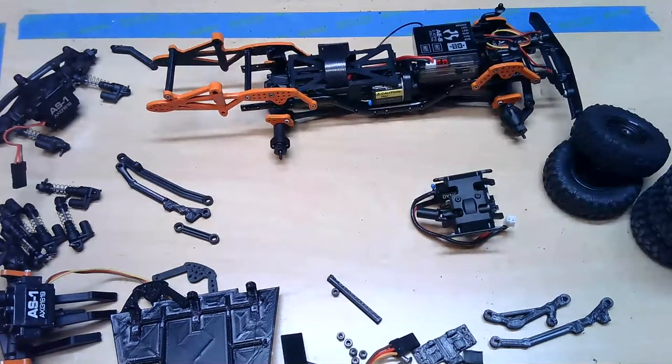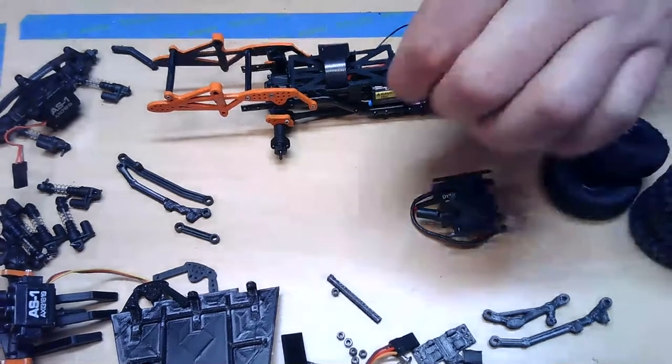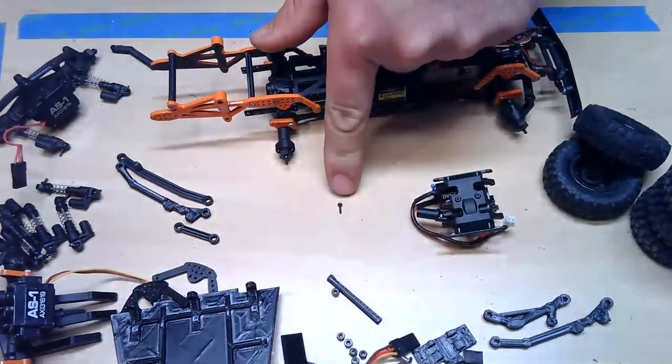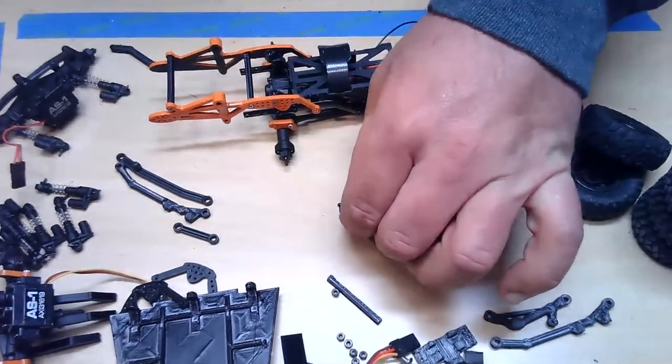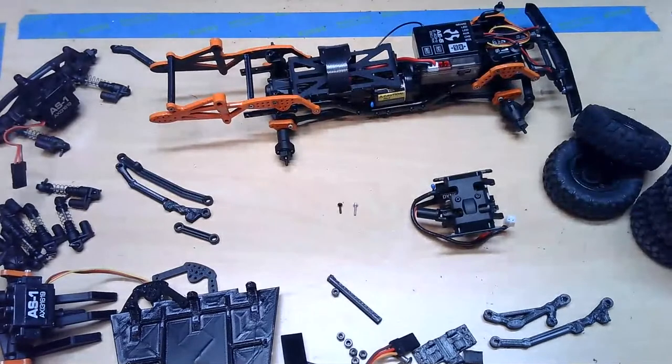It's really hard to find these stinking screws. The screws themselves are 1.4 millimeter diameter, or M1.4, and of the main lengths that I get, I don't even worry about the 5 millimeter ones. The stock ones that come in here, in almost every screw in here, is that little bitty guy, which is a 5 millimeter screw. So what I do, when I order my screws, I order the 1.4x6, which gives you a little bit more grab on everything.